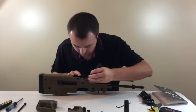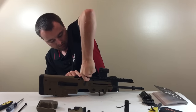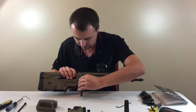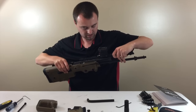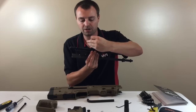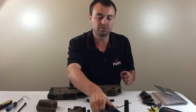With that held up, we're going to take the barrel wrench, put it in there, and start to turn it. This does start out very tough, and you're going to feel like you're going to break something, but it will start turning. Now it's super loose — line up that white line with the O. Barrel comes out. Now this rail — you can use your Allen key up on top here and take this entire rail off, but I don't need to do it for what we're doing here today. It doesn't really add anything to this detail strip.